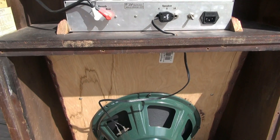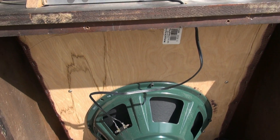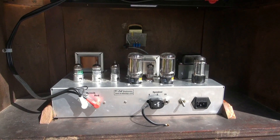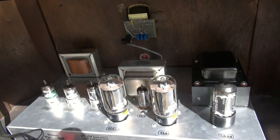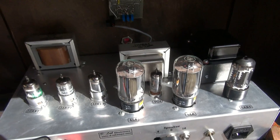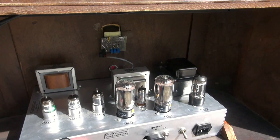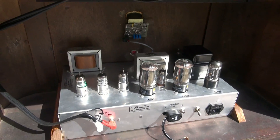Alright, so the back side — this thing features a 15-inch Jensen 100-watt speaker. Sounds super. It's a home-built chassis by D-Lab. It's got outputs for 4 and 8 ohms. Runs a pair of 6L6s with a unique D-Lab inverter tube in between them — little 7-pin guy. It's got a choke.